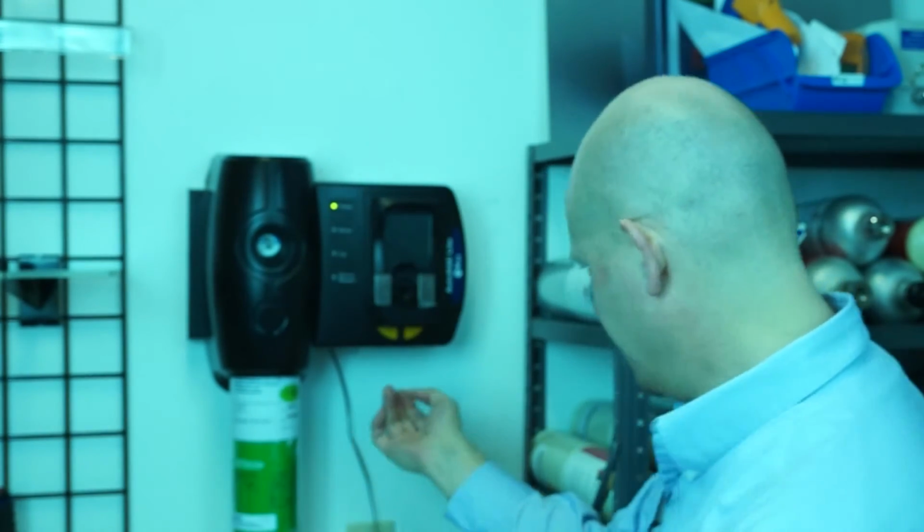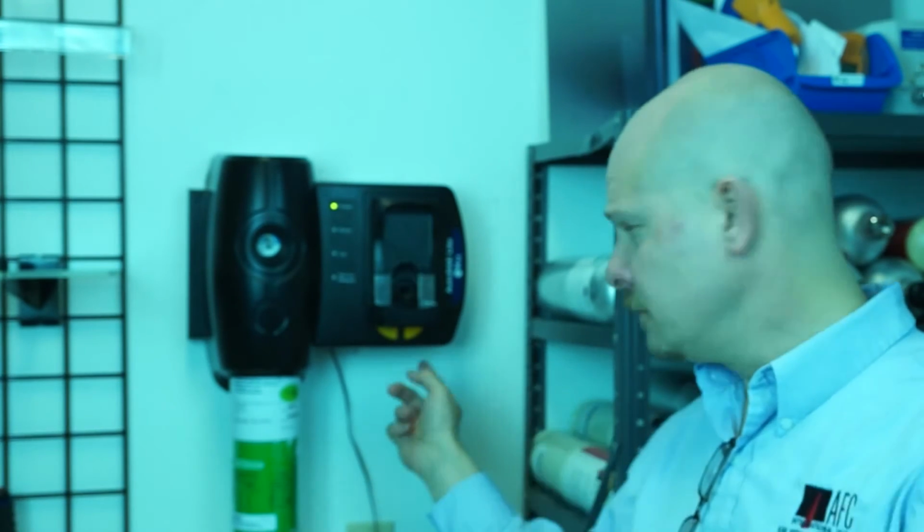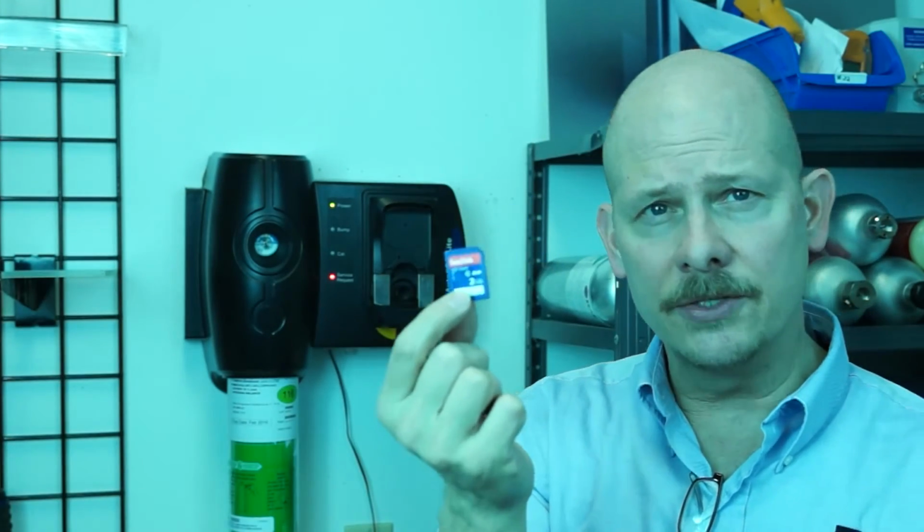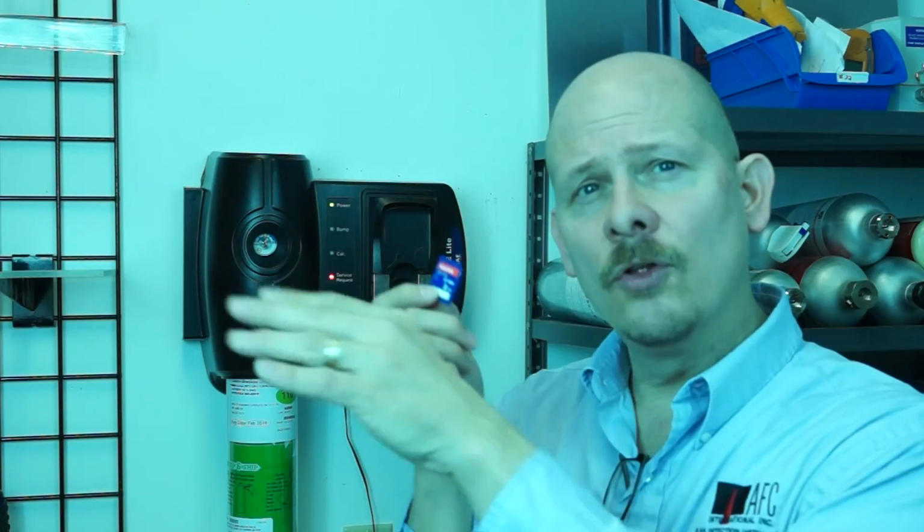The other area where we actually record this is on the AutoRae Lite itself. Underneath, there's a little port. You'll find a little SD card. Now, the SD card will retain all the bumps, all the cals, regardless of passes or fails. And it'll also record the serial number of the unit. It'll give you all the sensor configurations of the unit. It'll give individual pass-fail indications, like in an Excel spreadsheet, that tell you whether you passed or not.